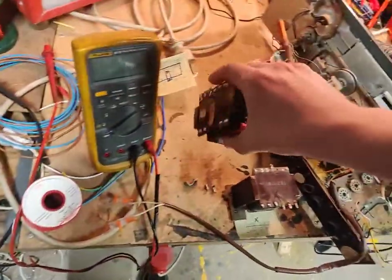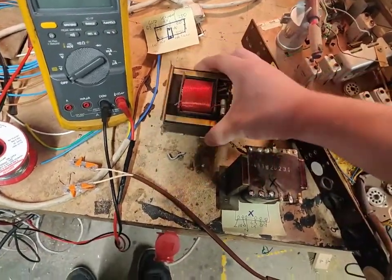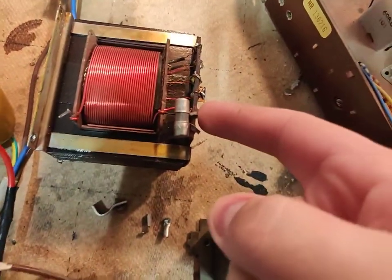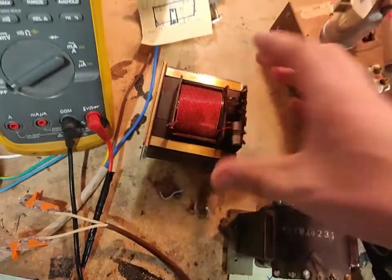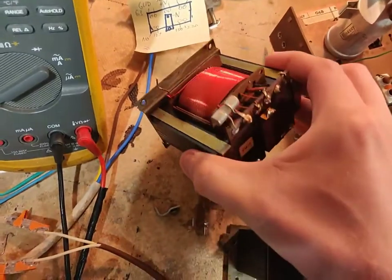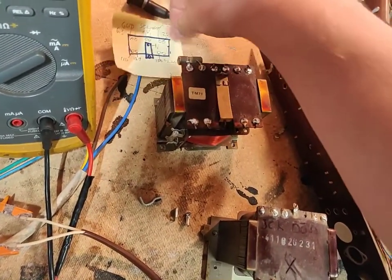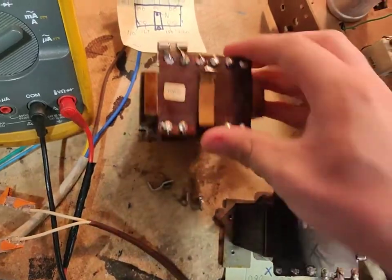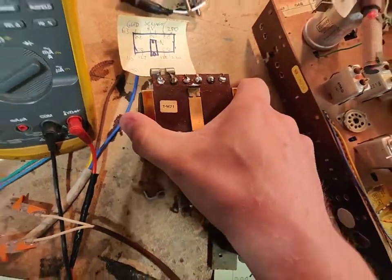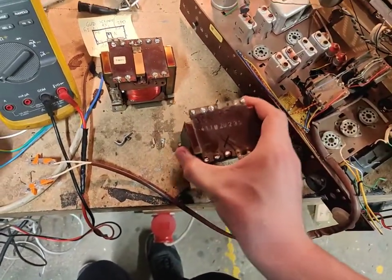One more thing which is that this thing doesn't have a center tapped 6.3 volt winding. And you can see here, there's the fuse here, so this is one side of the 6.3. This is where you're supposed to attach the filaments, and this is the other side of the 6.3 here, which went to chassis on that radio. Got a high voltage winding here, I believe. No, here it is. I got that marking here. That's the secondary high voltage right there. So that's 180 volts or something like that. So that's not really all that high, but I think it's similar to what this one had.